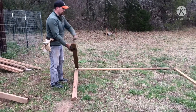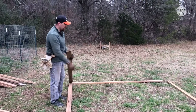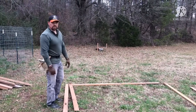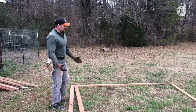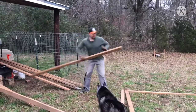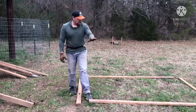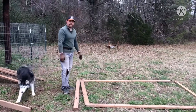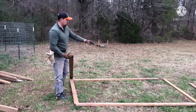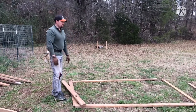The roof panel will go across and I'll probably need another bar in the front to support it otherwise it'll collapse. I've done a little bit of research — just Googled it and found a couple other people who built something similar. The basic idea: build a square on the bottom, put some posts on the corners, then run two-by-fours down on an angle at about 45 degrees. Cover it with some sort of plastic or metal roof paneling and you've got a fairly light, mobile structure you can drag.